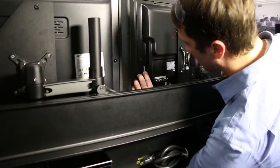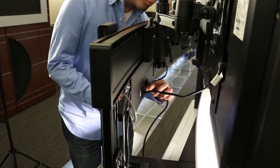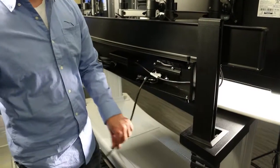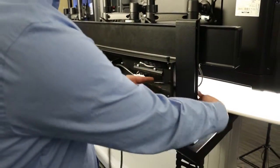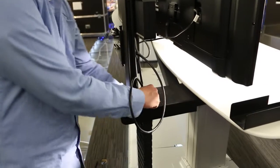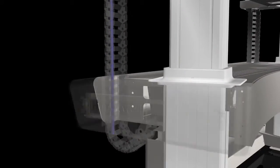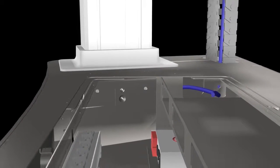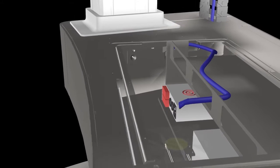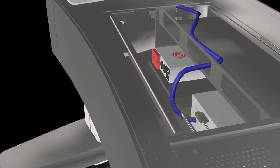HDMI monitor cables are threaded through the brush grommets into the slat wall cavity. The minimum cable length from the slat wall to the equipment tray is 3.35 meters or 11 feet. Thread the cable along the slat wall and down into the slat rail post. Pull the cable down the slat rail post and into the flexible cable track. Thread the cable through the opening in the equipment tray and onto the cable tray above the workstation. Excess cable length can be secured and rested on the cable tray. Connect the HDMI cable to the workstation.